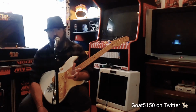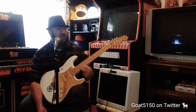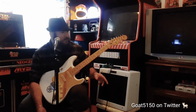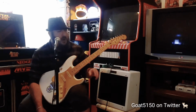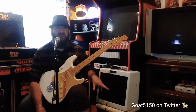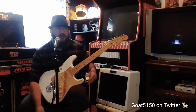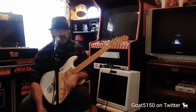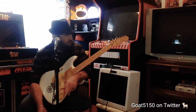Now, if you're playing a show with it, 15 watts all tube, it's 2 12AX7s in the front, 2 EL84s in the power section in the back, is more than enough volume to hang with a drummer. But 9 out of 10 times, you're probably gonna have this mic'd up and let the house do the work. And you're not gonna hear that cabinet resonance anyways. It's just going to be the speaker amplified through the house, and it sounds huge when you mic these up.